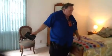Northeast bedroom. Ceiling fan was okay. And the sliding glass doors were good. Now, up on the east wall here, if you look, you'll see a minor leak, but this is something I believe is happening from that sprinkler system. It's not showing. Okay, you might want to go in closer. I think you would if you went in close. See that wall? No. Okay. I think you're better without the light there, Mike, actually. But anyway, there you have some blistering paint, and it's a minor thing, but diverting those sprinkler heads away from that east wall naturally will remedy that problem there, okay?